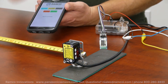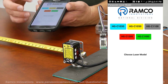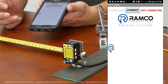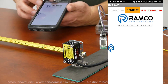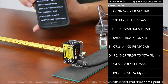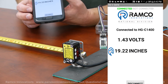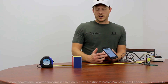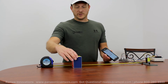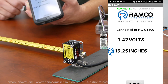Because there are five different models of laser sensors to choose from, I set up different models here to choose, and I'm going to go in and select HG-C1400. Then I have to connect to the Bluetooth device, so I go in and I look for HC-05. So I'm connected, then I'm going to have voltage on the screen as well as the sensing distance. In this particular instance, I've got this module set about 19 and a quarter inches away from the sensor, reading 1.420 volts.